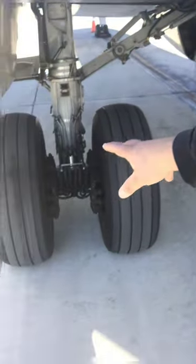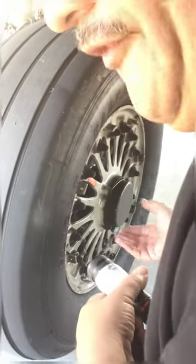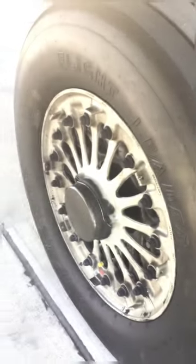We're looking at the body frame right behind us, making sure all the panels are secure, no screws are missing, and on the ground we don't want any kind of fluid. Looking at the main gear: inspect the tires and brakes again. Number one brake pin looks good, tire wear looks good. Number two brake pin looks good, tire wear looks good. Make sure all your tie bolts are there — that's your safety. Looking at the sidewalls — no bubbles, all tie bolts in. Hydraulic lines, no leaks — everything secure.